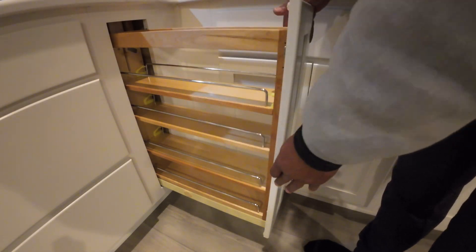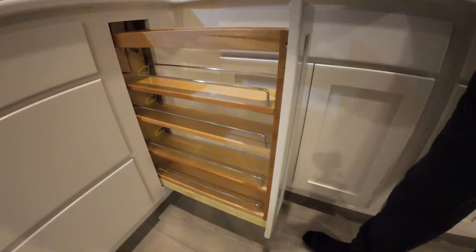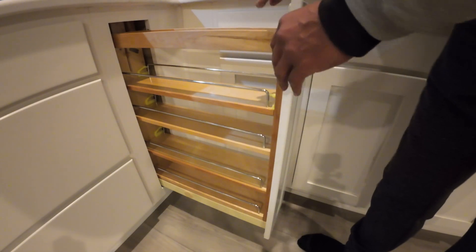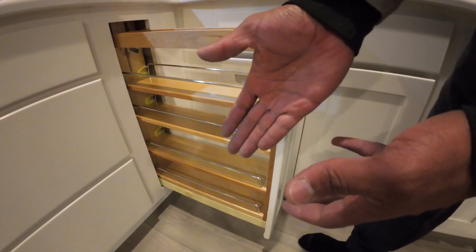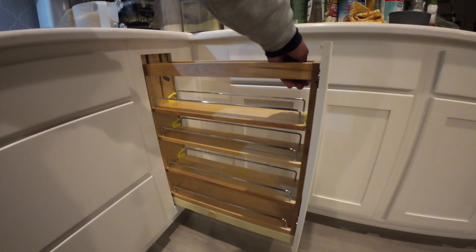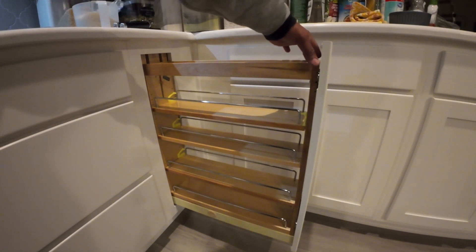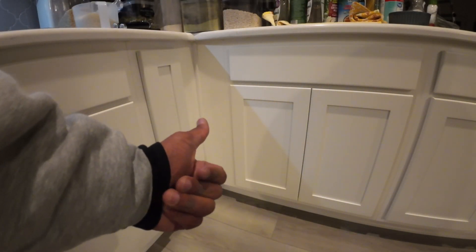Go to the opposite side — in this case it would be the bottom. Once you get that leveled and set, it'll make it a lot easier to get the other two screws set on the other side. Once you have all your screws set on all sides and bumper stops installed, be sure to tighten up the three-eighths nuts that are holding the little sliders that adjust to the door — and that's it, we're done. Thanks for checking out the video, catch you on the next one.